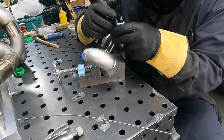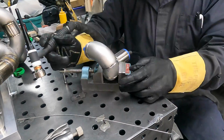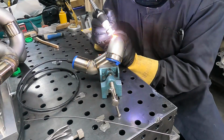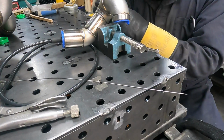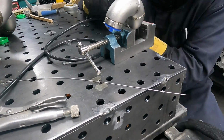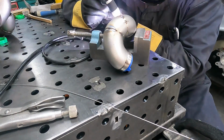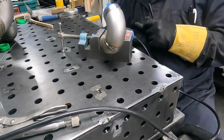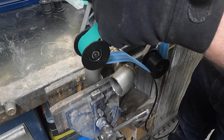You have to start the weld on the pipe, and you have to start it kind of tangent to either the long or the short angle. So what I'm doing here is correct. Don't start on that short side or the long side of the radius. Start sort of 90 degrees to that, and weld either side of that. That seemed to be the best to keep the pipe in line and to not have it shrink out of my way and to not have it do anything really foolish. Now, this particular pipe, these ones that kind of come up and hook around, they're the troubling ones.